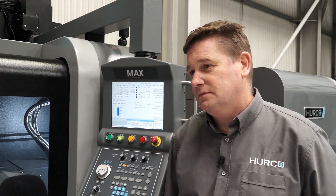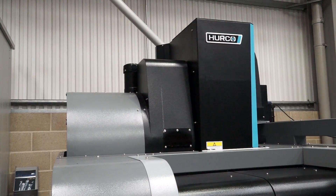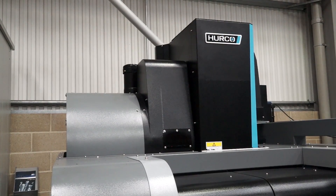With 5-axis machining you might need things like through-spindle coolant — that's available, is it? Yeah, that's an option, and you've got the ring coolant where the coolant goes right the way around the spindle. And with swarf extraction — standard swarf conveyors? Yeah, you've got swarf conveyors, standard ones, or you can have the actual chip conveyor as well.